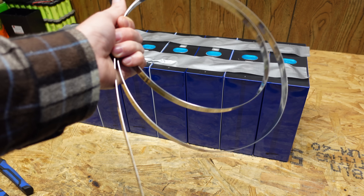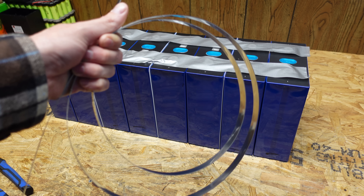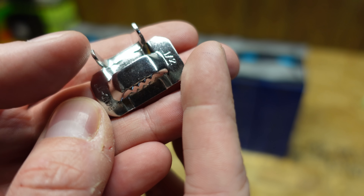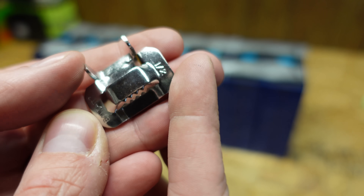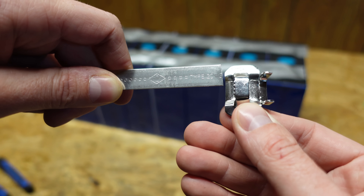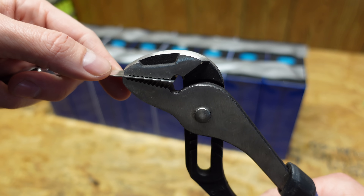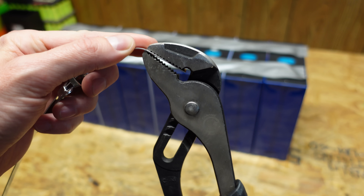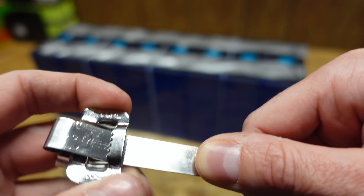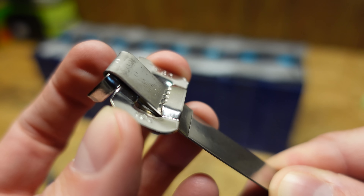I've cut off a 68-inch piece of the strap. From previous testing I determined 68 inches was the best length — it gives me the amount I need to grab with the tool while not wasting an excessive amount. These little buckles are used for securing the two ends of the strap together. This particular buckle is made for half-inch strap. You can see there are teeth on the top and bottom which really grab the strap and help keep it in place. I slide the strap in from the front so that the two pieces you squeeze are in the back. Then taking a pair of pliers, I bend down approximately one inch of the strap, and on the bottom side that slides under this pair of teeth. Once tightened, these teeth grab the bottom piece and prevent it from backing out, in addition to the folded-over loop.